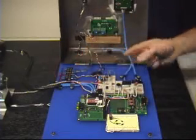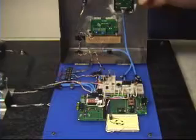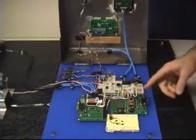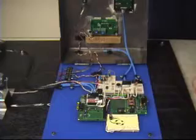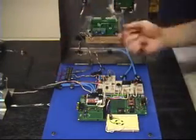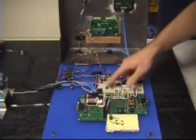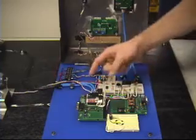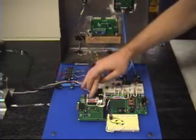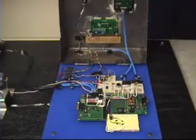Got a voltage bank here that's then broken down into what's needed for each component. Our generator actually outputs AC voltage, so we had to go through a full bridge rectifier before going into our main circuit. So the voltage that's generated by the generator is then read by our A to D converter, and then is read by this PIC, sent back over to our main PIC, and then displayed to our LCD to the user.